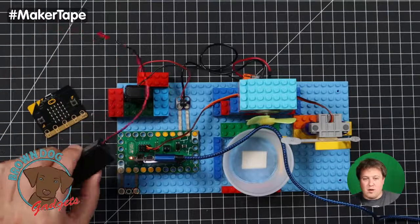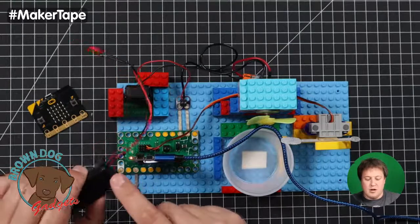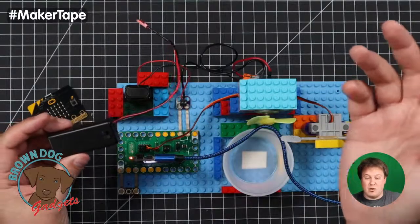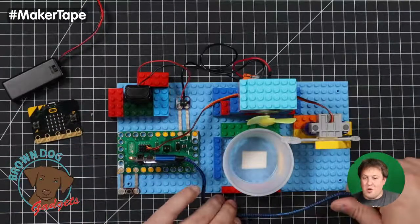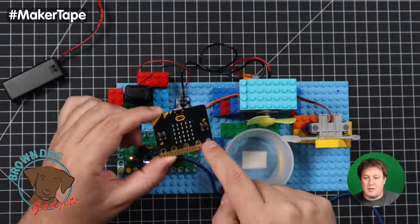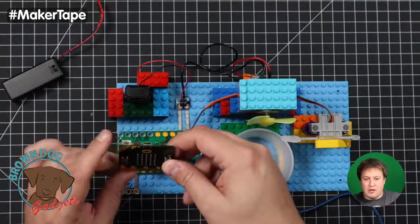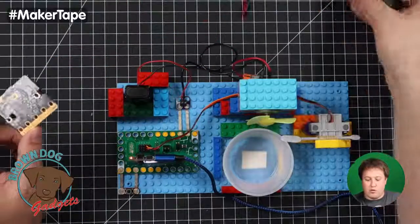But for our micro:bit, when we did this in the video, we powered both the board, the micro:bit, and the setup in general from just a 2 AAA battery holder, which we are including with our kits. We found that these Lego-based servos tend to need a little more amperage than the micro:bit can shove through itself. I think these pins max out about 100 milliamp, maybe. We just never have reliable luck powering the servo through USB or the battery insert on the micro:bit through the board out to it, which is why we use another power source to power everything through the board.